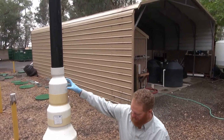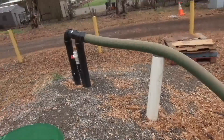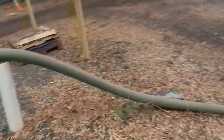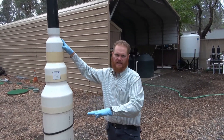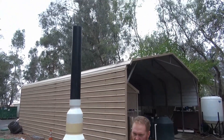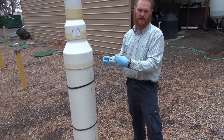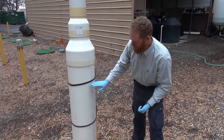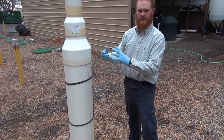This is a filter that filters the gases that come out of the tank — methane, CO2, and any odor-causing gases — through a bed of activated carbon, which absorbs the odor-causing gases. We also think there's some bacteria that grow in here called methanotrophs that break the methane down into CO2.